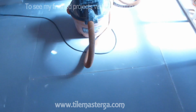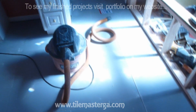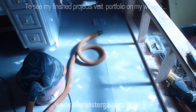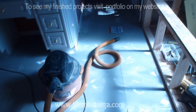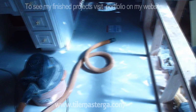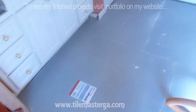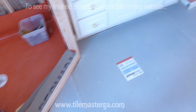The type of thin set that I'm using is a latex modified product that bonds extremely well to the wood, in this case to the subflooring. It's not just the cheapest thin set that most contractors like to use to save some bucks. It's from the higher shelf. It's latex modified, a premium product, and this is the type of setting compound that I'm using to mount the underlayment, and then later to work with the tile work.